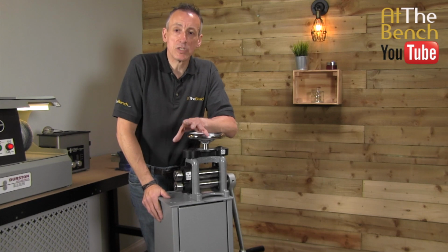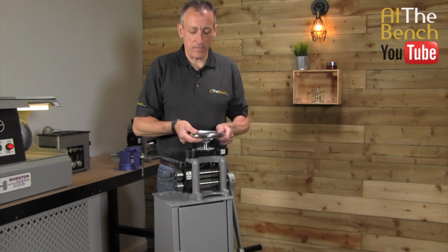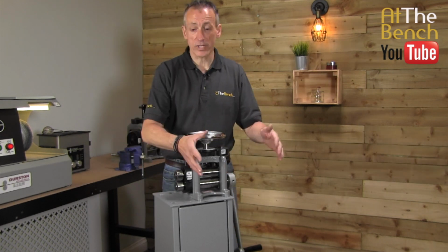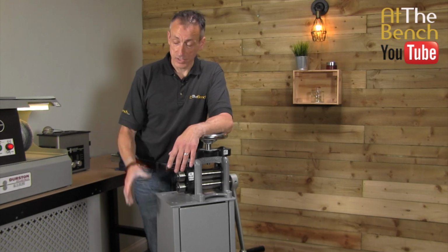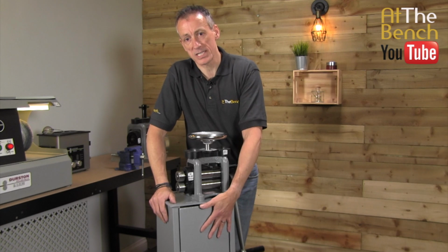Believe you me, you really do need to have it bolted down for safety, because this little mill is fairly heavy. The base is pretty heavy, but can you imagine that falling over? You go into it, you knock it and so forth, it's going to make a dent in the floor and you're going to be in hospital if it lands on your foot. So the disadvantage with the pedestal in the cupboard is that it has to be bolted down to the floor.